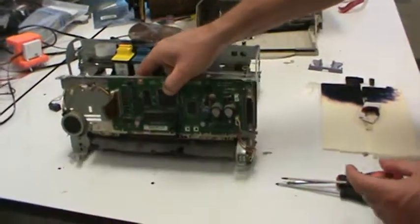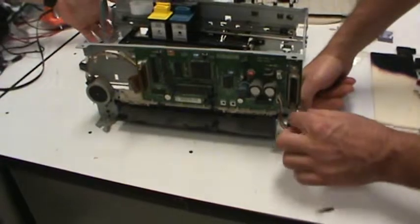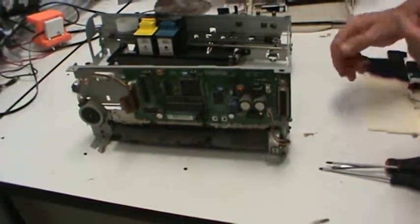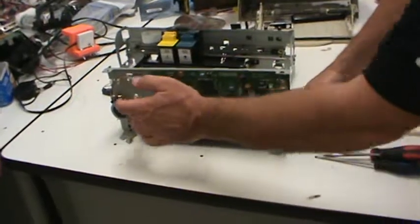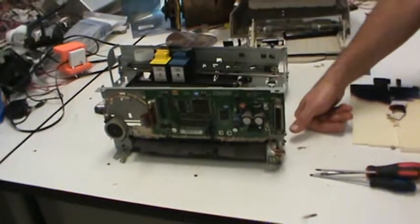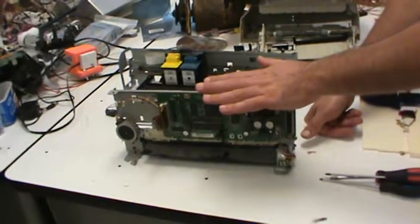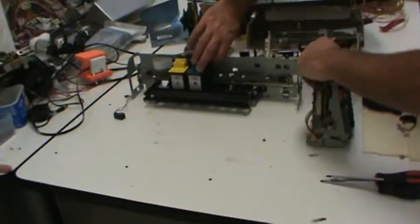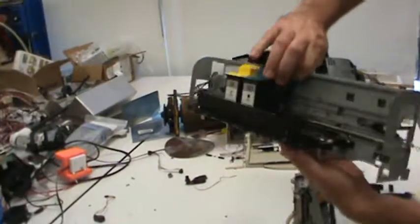Why was this inkjet printer not useful for us? The reason is it had two stepper motors. I was hoping we'd find a printer that had a stepper motor and a DC motor, or at least a DC motor. So we might use this for a couple of the initial laboratories. We'll probably put this printer with that other one — the other one only has DC motors — because I do want you guys to learn how to operate steppers as well as DC motors. We'll put this one with the other one so we've got both DC and stepper. This platform will serve just fine for one group because it has a stepper for driving the paper and a DC motor for driving the carriage.